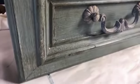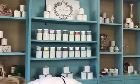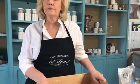Deb asks: can Cracked Patina be used with milk paint, or only Cracked Gesso? Great question. The Cracked Gesso is for cracking milk paint — we're the only company that has developed a product for use specifically with milk paint. It gives you a beautiful natural fissure crack like you'd see on a real antique piece. If you want to crack the One Step paint and get a chippy look, you use Cracked Patina. Don't use Cracked Patina with milk paint. Another question: can you use antiquing glaze on wood or gel-stained furniture? No — the antiquing glaze is formulated just to go with milk paint.